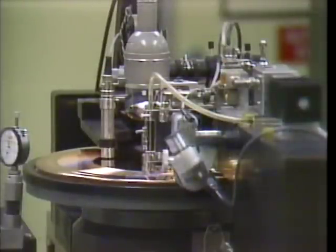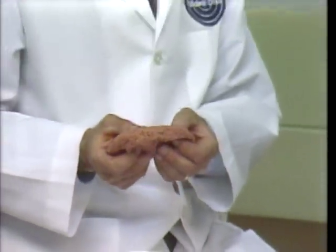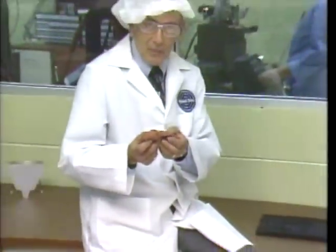This lathe is recording a frequency modulated, or FM signal. Its diamond cutter is moving up and down 3 million times every second as it traces out that signal. And this is what's left over. 12 miles of continuous copper filament, finer than the finest thread. By the way, the lathes are mounted on a floating suspension system. Just the slightest seismic disturbance could alter the signal cutting process.